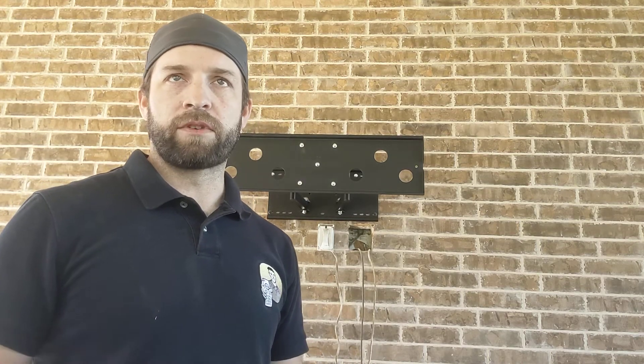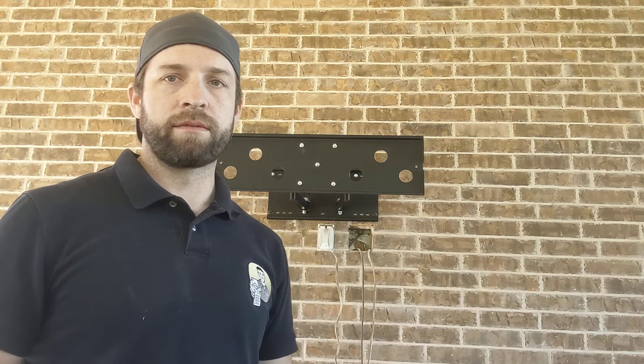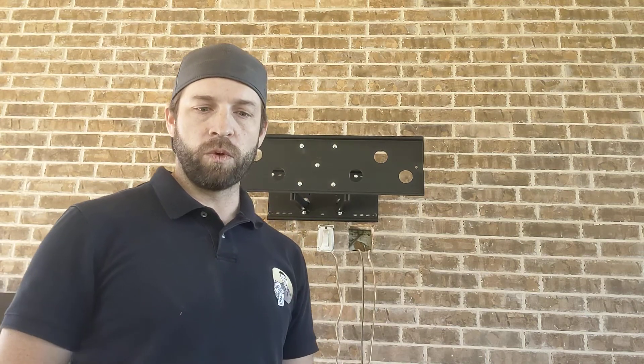That's how I do it. I've come across brick walls that just aren't — brick walls aren't load-bearing, they're not structural, so they're actually tied to the wall behind. It's okay to mount to brick walls, they're usually pretty strong, but there are a few cases where the mortar is super soft or the wall itself — you can feel it move, they didn't do a good job securing it. In those cases, I send a lag all the way through to the stud behind.